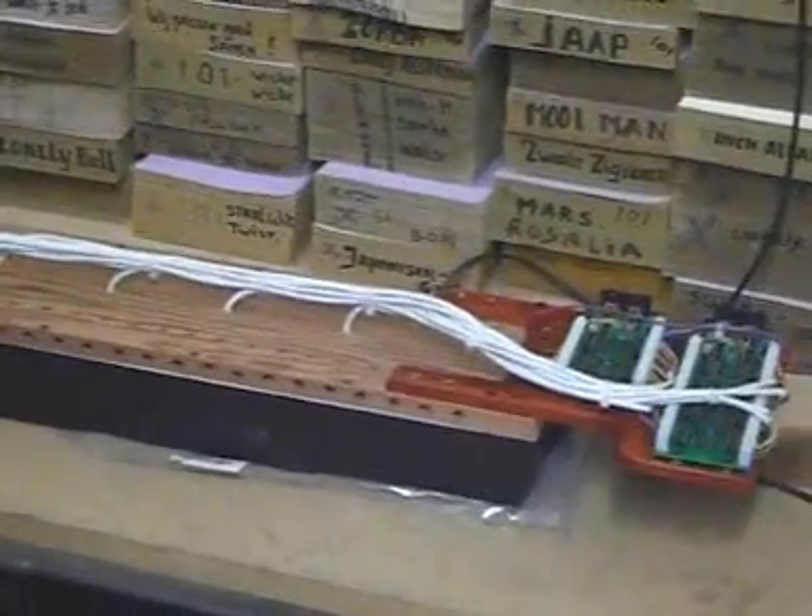That relay chest is the MIDI conversion. It interfaces between the keyframe and the original primary relay. It's split into three sections — the center section has all the tubes coming off, with its wind supply going straight to a tremolo unit, handling all the melody notes on the action. That's quite a clever way of doing it, rather than applying tremolo on the main air supply for each individual wind chest. The two outer sections have constant wind supply and also operate as a relay for the register chest, amplifying the signal.